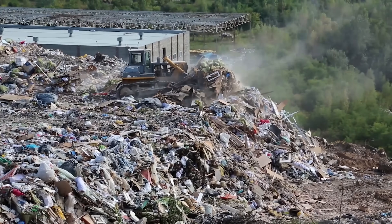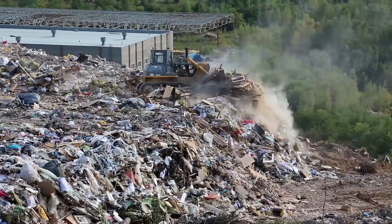This one is going to seem really silly — a rag. But pretty early on I discovered that not all towels are created equal, and that paper towels are just not viable or environmentally friendly. You could use wet wipes, but some of us actually care about the planet. I went through a process of testing out different towels and rags, and I discovered that most types leave a ton of little fibers on your build surface, which will either lead to bad bed adhesion or wind up embedded in the first layer of your print. To avoid ugly and problematic first layers, switch to one of those microfiber cleaning cloths, which leave far fewer fibers.